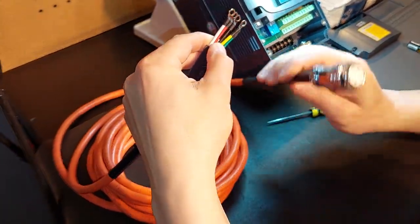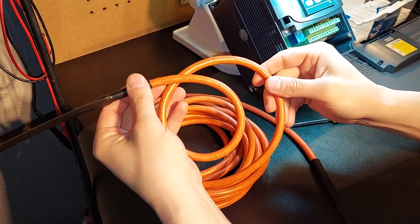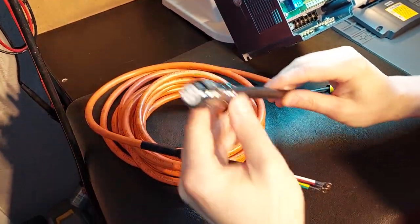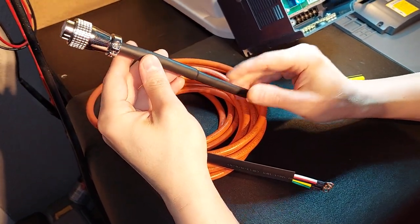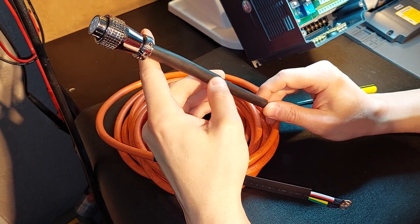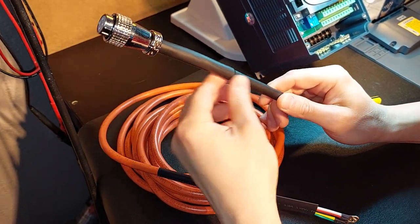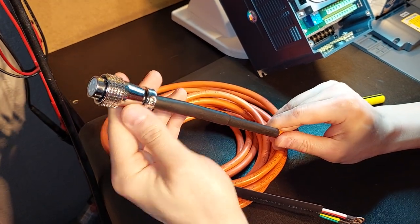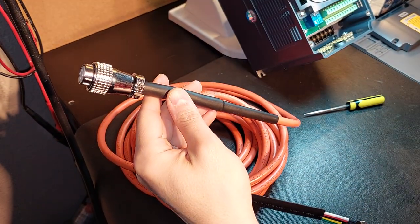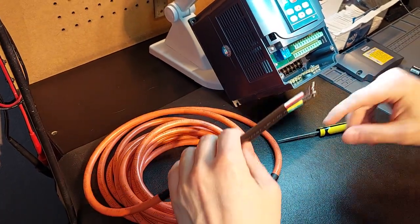This is how you connect these VFDs. If you're looking for an assembled cable like you see here, this cable has ultra-flex — you're not going to get that with a standard double-shielded cable. It has a 2.9-inch MBR rating. You can see the double-wall heat shrink that's been used. It actually has one sheath of double wall and then over that we put another sheath to make this ultra-rigid at the end where it connects, giving us stress relief. We use the proper blue Loctite on our screws for vibration as we should.